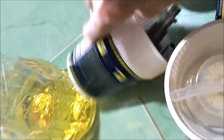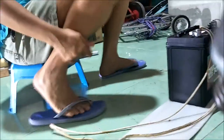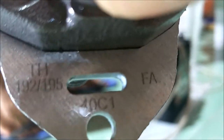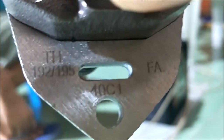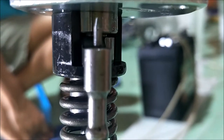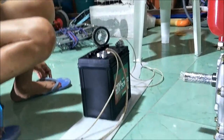They'll try to sell you a fuel pump — here's the fuel pump right here. If you read this little label you can see it says 190-something — I think it says 192 or 195. That's what you don't want. See this little thing with the ball hanging upside down and a pointed thing on top? That's too long, and that is your fuel control. Let me put this down and give you a better idea — this here is your fuel control.